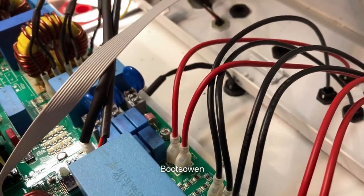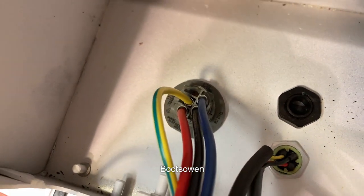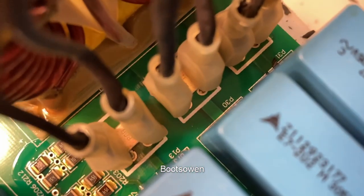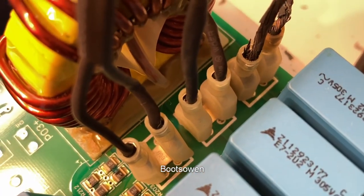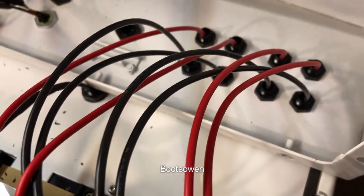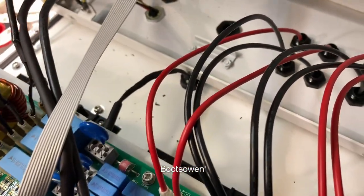What's to do with it? I've been told don't scrap it, but I'm not too comfortable with it really. You've got an earth on this plug and you've got three phases. I can see in here — I can't see any IDs on the inputs. Normally with these they'll say L1, L2 and L3, but it doesn't in this case. The DC side's pretty straightforward, it's got four inputs. This wire here goes to a fan unit on the back — I think it's got a built-in fan on the heatsink on the back to keep it cool, which is smart enough.